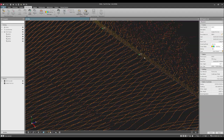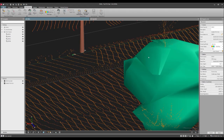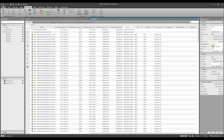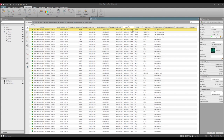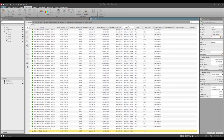Leica Infinity allows for reporting where we can assess the quality of the data, but in this case we'll simply compare some linear features with the scan features by zooming in, panning around, and seeing how well the curves in each dataset line up. Now that the data has been QC'd, we could create deliverables directly in Leica Infinity or export our project to another office package like Autodesk or Cyclone 3DR. David was working solo today and we were in a time crunch, so let's go into the inspector and look at the timestamps on the first and last point of the job. You can see the last point was taken at 5:49 and the first measurement was taken at 4:09 — so an hour and 40 minutes to do four resections, four scans, and collect over 300 topo points with coding and line work of the features surrounding the building.